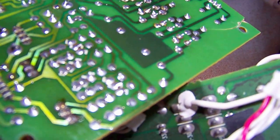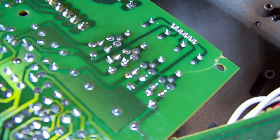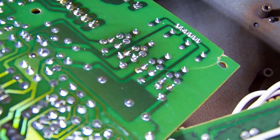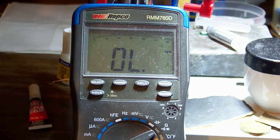I'm curious to see the underside of this board and make sure the solder joints look alright. Some of these rigs look pretty warm with a discolored board, and these caps have seen a bit of heat - we can probably check those. Someone has been here before - there's a giant crack through the PCB, and it looks like it may have broken at least one trace there. I'll just check the continuity through that trace. It seems okay but it certainly looks like it's cracked through the solder mask. I might run a wire just to make sure it lasts.